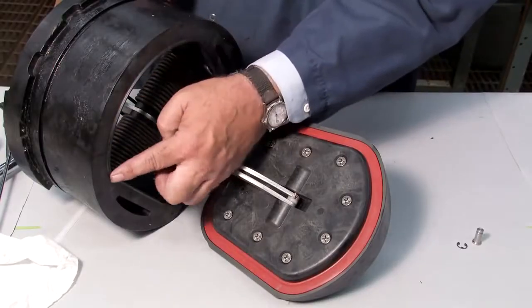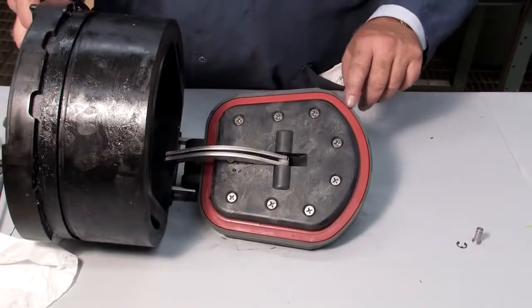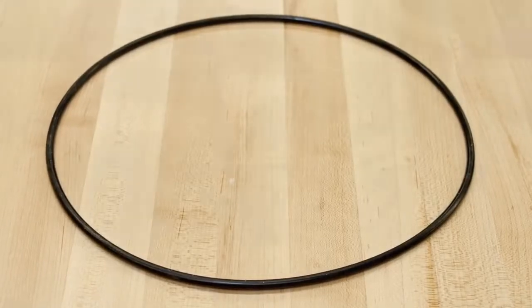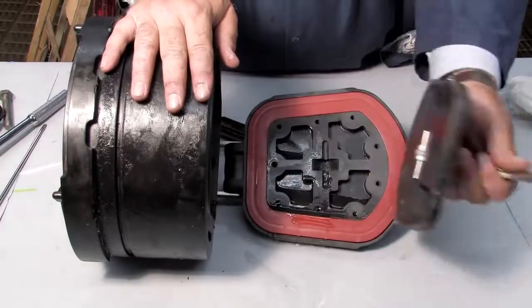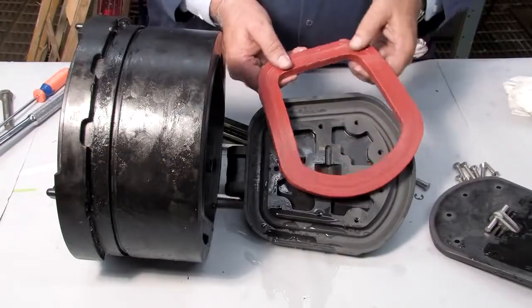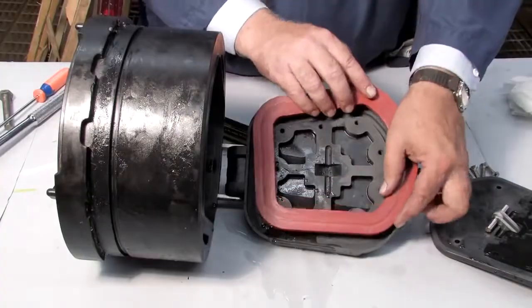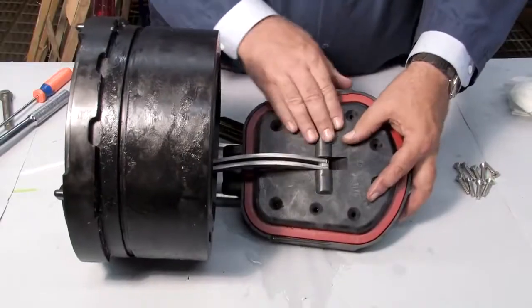Closely inspect all parts of the check including the check body, the check clapper and sealing surface, the rubber sealing disc, and the o-ring and o-ring groove. For closer examination of the rubber sealing disc, the keeper plate can be unscrewed and the sealing disc carefully removed with a flat blade screwdriver. If one side of the disc happens to be cut or torn, the disc can be reversed and reinstalled in lieu of ordering a replacement. If both sides are damaged, it should be replaced.